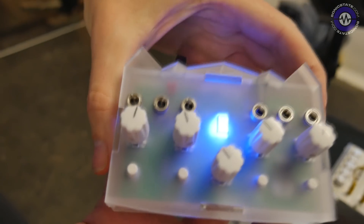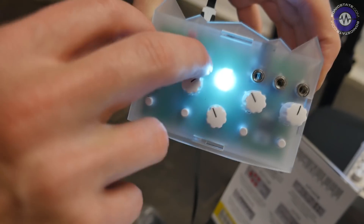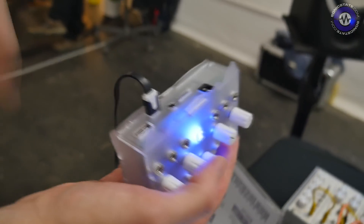Can you generate CV from the output? Absolutely — it's got two CV outputs, one trigger output, two CV inputs, and one trigger input. With the USB host interface you can plug in your drum pads or a keyboard and you've got a mobile synth. Another development stream we're prototyping involves analog oscillators and filters tied with digital control, looking at what can be done in that field. I think we're only really scratching the surface of what's possible.